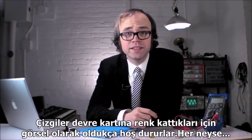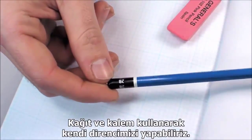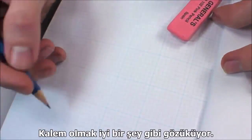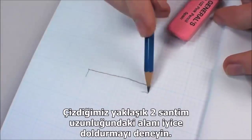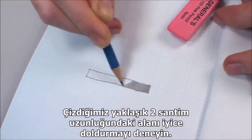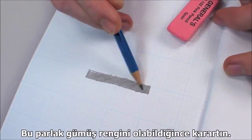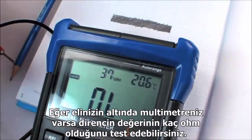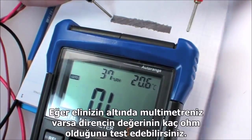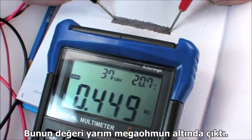These stripes are kind of nice because they have a way of visually livening up a circuit board. You can make your own resistor using paper and pencil — a 2B pencil seems to work well. Try filling a space about two inches long very thoroughly; get it just as dark and shiny silvery as you can. If you have a multimeter handy, you can test the value of your resistor in ohms. This one turned out to be just under a half megohm.